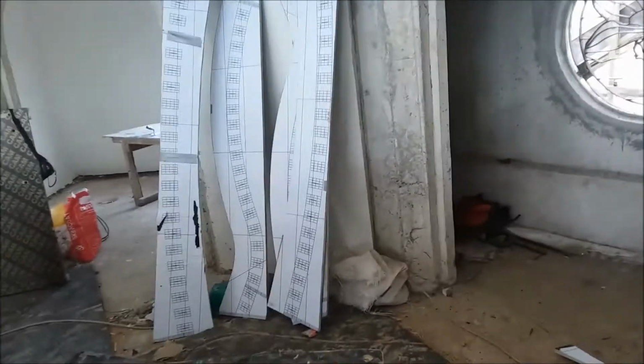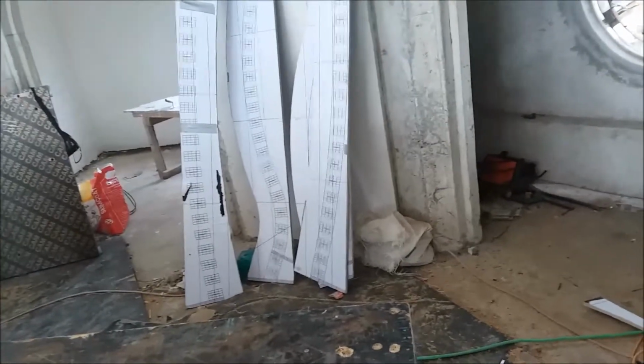Okay, so let's see if we can explain this a little bit. The printer over there, we commonly use the 42-inch wide large format printer up there because I know they have a couple of them that size, and that's the one they used for our building permit. They took the CAD drawings, which are electronic on a thumb drive, and they printed an acetate sheet. And from the acetate sheet, which is where they generally end up starting with, they printed 8 copies of everything for the building permit. So I knew they have that 42-inch, and I just draw everything up with 42 minus a 3/4 border.